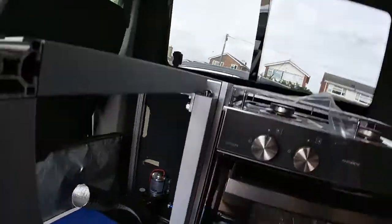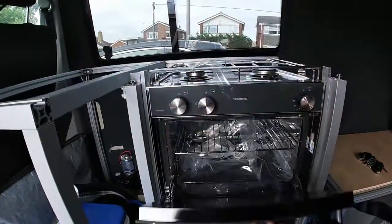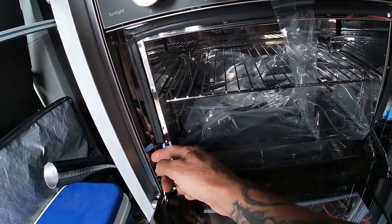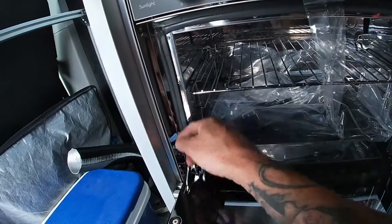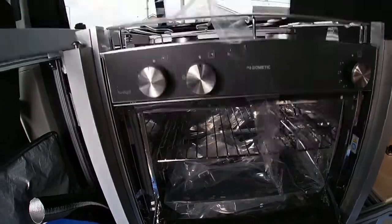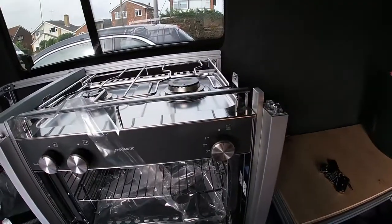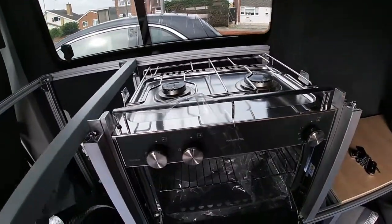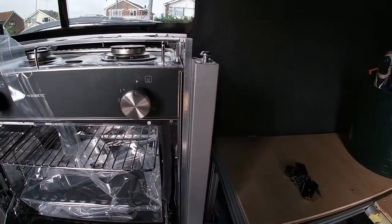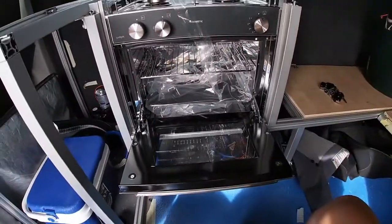So this is a piece I've made — it's all drilled and tapped, just gives it a nice neat edge down here and enables me to fix into that now. I'll get my centre punch and get a couple of pan heads in here — it's going to fix the oven good and proper. I think what we're going to do as well — we've got these pieces here where the gimbals should be — I think I'm going to drill the rivets out and remove them because it'll look nicer. They're only a couple of rivets. Nearly done.